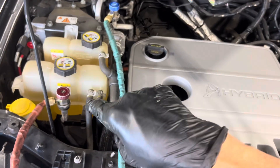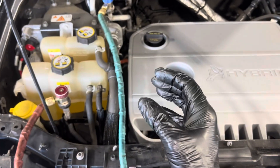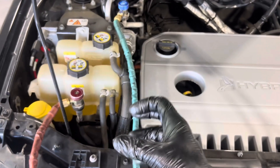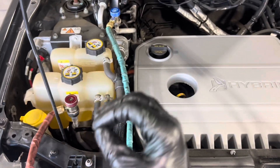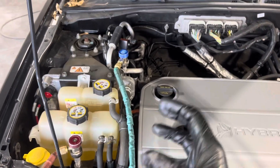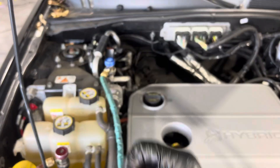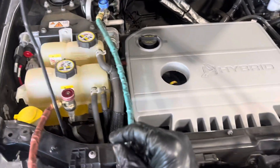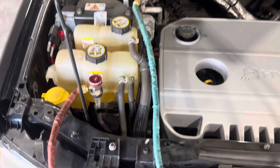This system uses POE oil — ester oil. Ester oil breaks down; it's kind of like salad oil. If you've ever smelled rancid salad dressing or olive oil that's two or three years old, found in the back of a closet — that is exactly how this smells. That's the best way I can describe it. So there were some issues, and something has definitely been done to this vehicle.